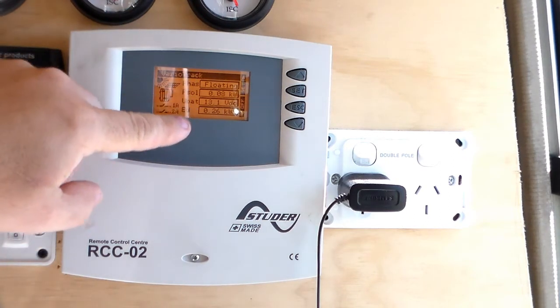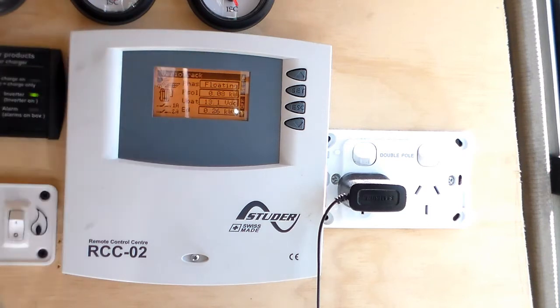You can change what information is displayed on this panel, and from here you also control what's called the auxiliary relay. Basically it's a contact, no contact type relay, and you can tell it to make contact or remove contact at a given data point for any one of these or many more. There are hundreds of things, and again, if you want to know about it, look it up. The auxiliary relay I'm using to remotely control the generator.